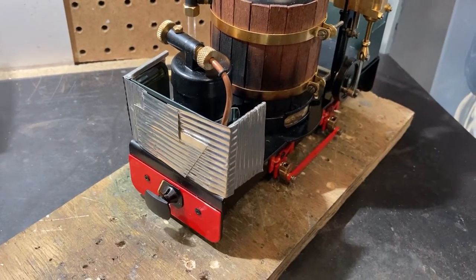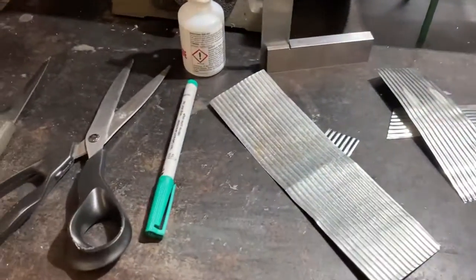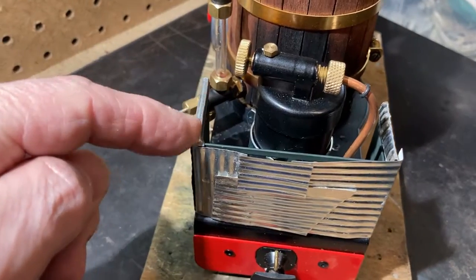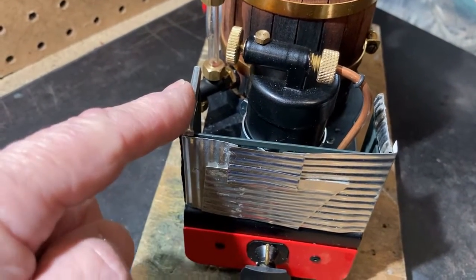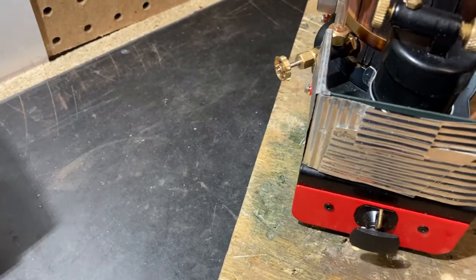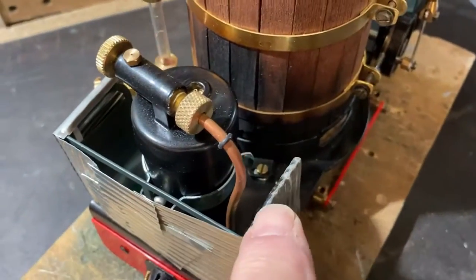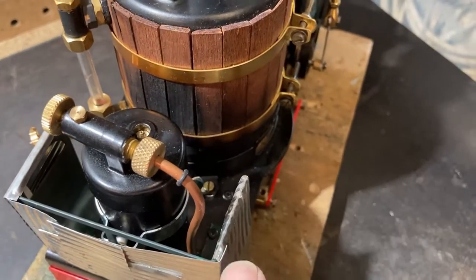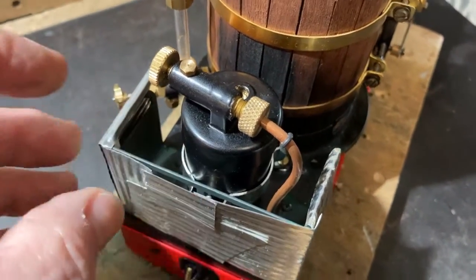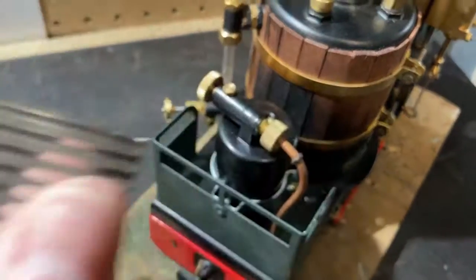Well, that's the first one done — quite easy and enjoyable. The material is very easily cut with scissors. Some lessons learned: this edge here I'm really quite pleased with. A trick here is to fold it and then fold it over something — I'll use the edge of my square there, something a bit thinner — and then fold it again and trim it at the bottom, so you get a good fit. The first one I did was here, which I'm less satisfied with, but I may or may not replace that. This metal stretches like nobody's business, so you can see there's a bit of a smile — I will probably put a window box there or something equally bonkers, and it will just slip off like so.